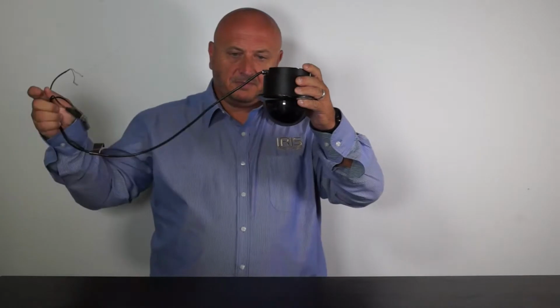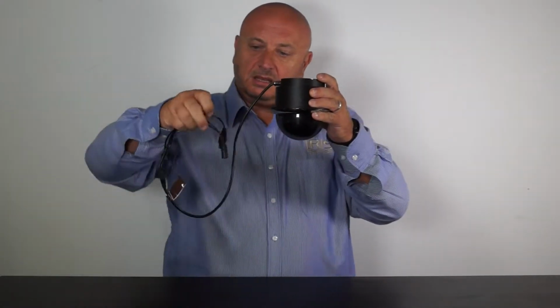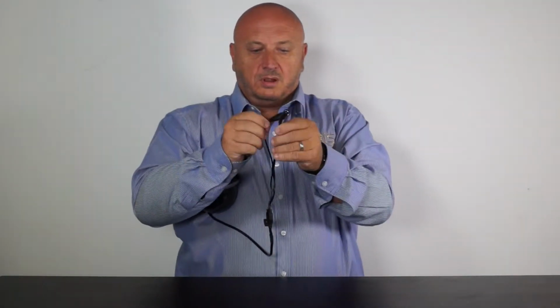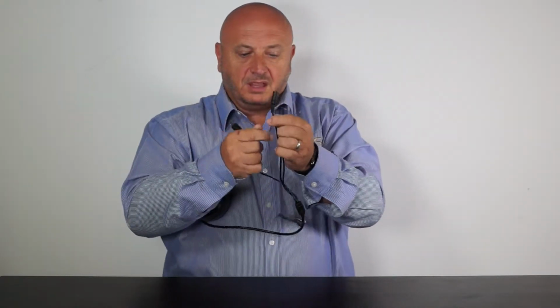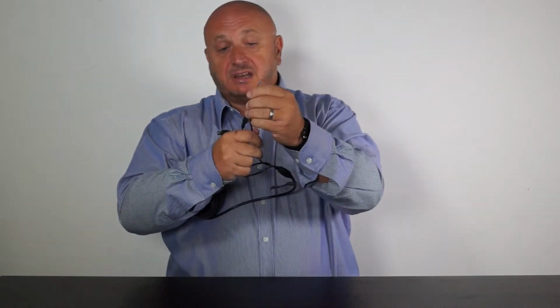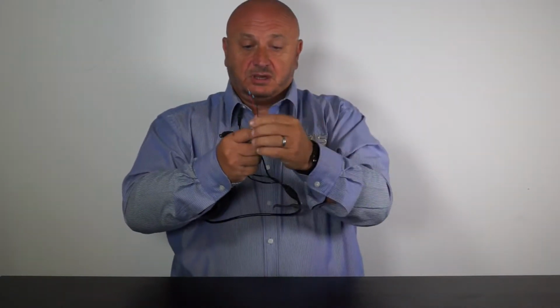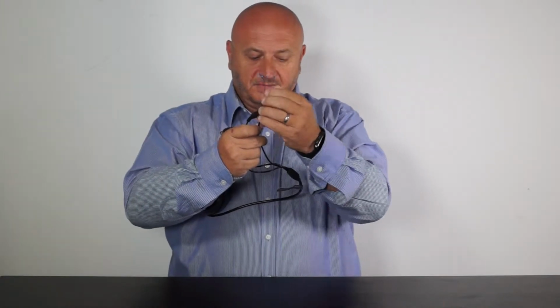Out of the base of the camera comes our pigtail cable, and there's 3 cables that need termination. One of the cables is our favourite BNC video connection with coaxial cable. There's a 2.2mm barrel jack for 12 volt DC power, and there's a black and red cable, not to be confused with power, that is RS485 telemetry. So obviously red's hot for the 485 telemetry. This gets wired into our 516 joystick, and I'll explain that in a minute.